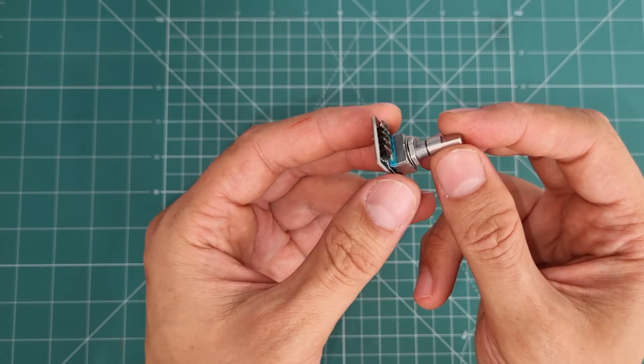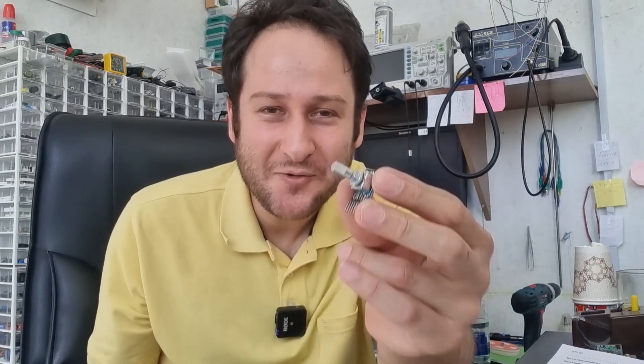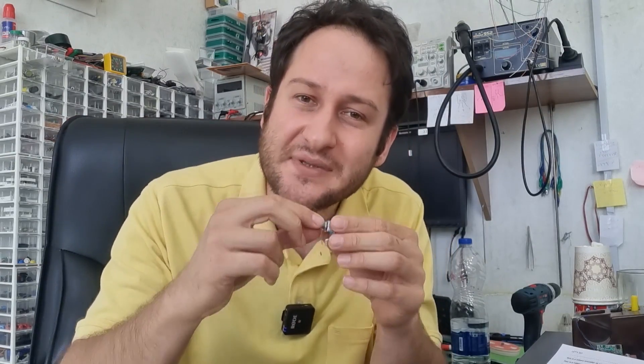In this video you will see what exactly rotary encoders are, how they work, and how to interface them. This is a rotary encoder, a very useful component, but sometimes wrongly called a digital volume or digital potentiometer. This little component informs every rotation — clockwise or counterclockwise — of its handle by digital signals.